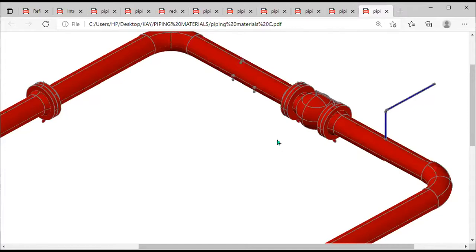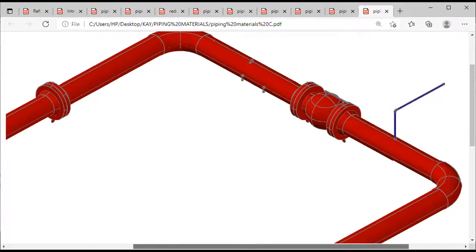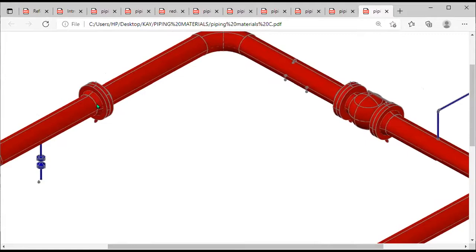Like now, let's assume that this line is something that will require regular maintenance. You can't come and weld this thing together. Because if you weld, when you want to maintain, that means you have to dismantle, destroy what you welded. But if you bolt this thing together, when you want to maintain, it's just for you to unlock your bolt, open it up, and you carry out your maintenance activities.